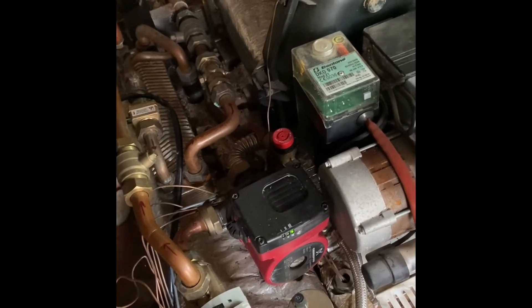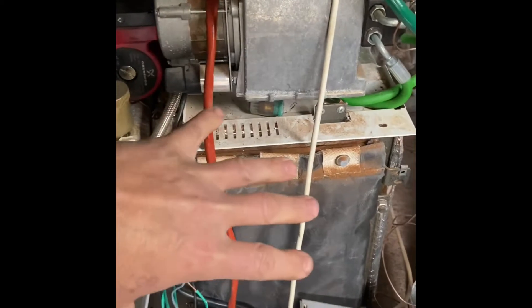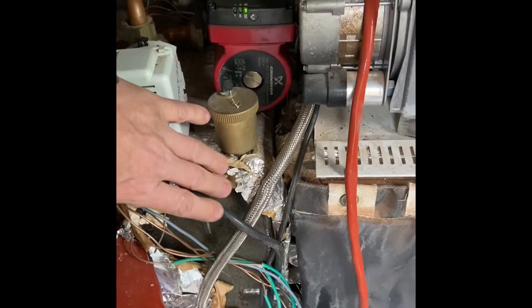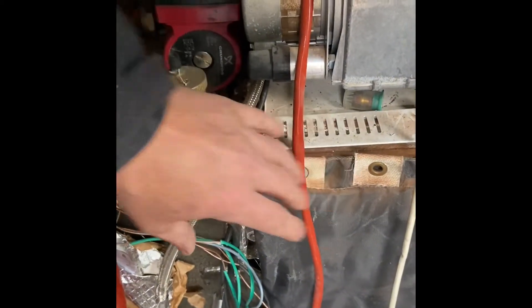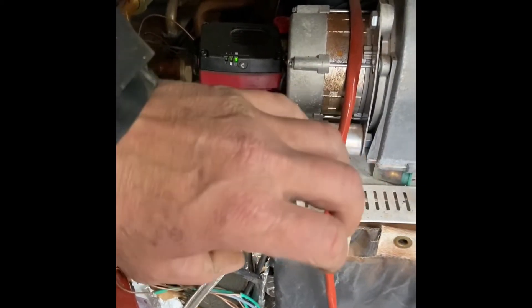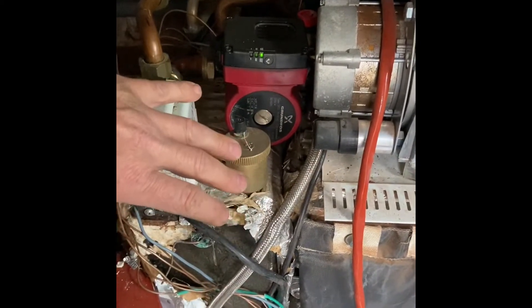The diagram I'm about to show you — we're going to take the burner out of the equation and split these two parts apart, because they are actually separate. Here's your heat exchanger, and here is basically your domestic hot store — but it's not fresh water, so do not think this is like a cylinder. It's not. It's still the same dirty central heating water. Because your oil flame is not fully modulating like a gas flame, it can't absorb as much heat instantly, so you need this buffer to give you tremendous hot water flow rates.